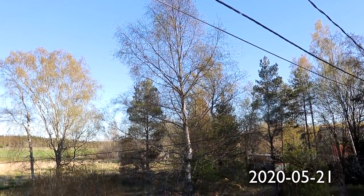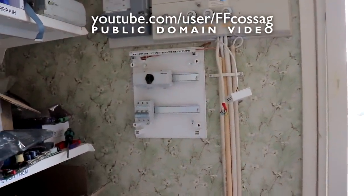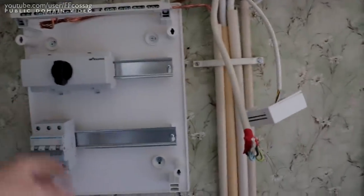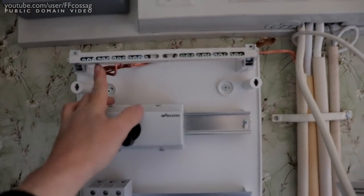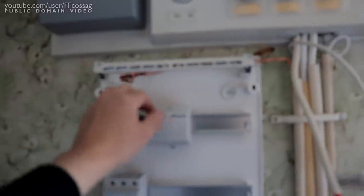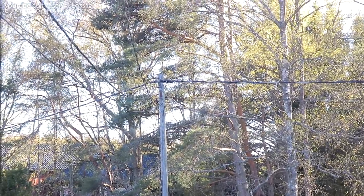It's a beautiful day outside but we're not there today, because today's the day I finally start doing the inside stuff. I've kind of been dreading this because I'm a novice at setting up these electrical panels. I've maintained this one as well as the one in the basement. For starters, the most important thing is done: we've got our potential equalization ground lead going straight down to the trench, so we have good ground here - better ground than we actually have there, because that just goes out to the electrical grid and who knows where the next ground point from that pole is.